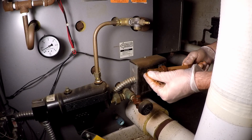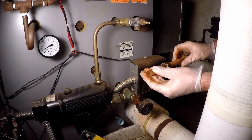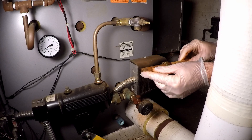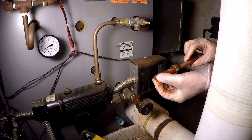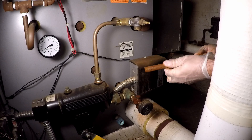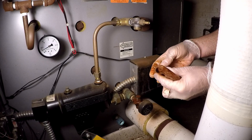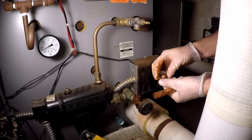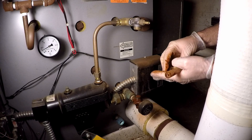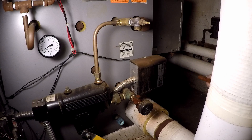After doing all those precautions, which should be common sense, you tighten that bottom valve for sure. You can also tighten the top one, but I had some difficulty doing that — my little black hand valve actually broke, it's just plastic. Fortunately, the bottom one was fine. You tighten the bottom one to make sure the water doesn't keep flowing when you disassemble the sight glass.